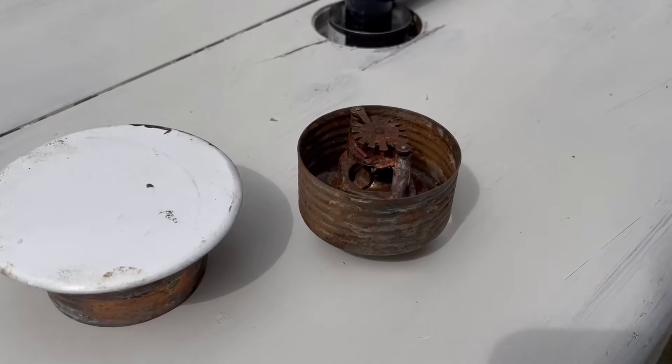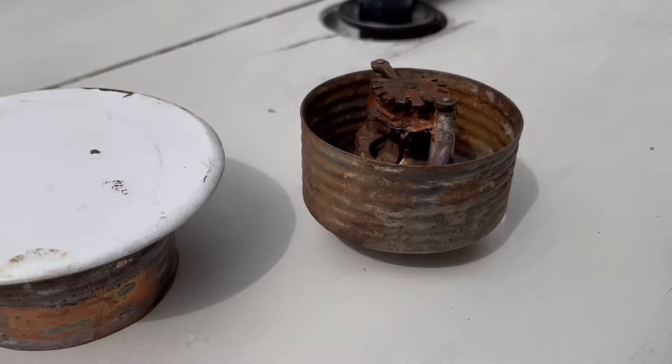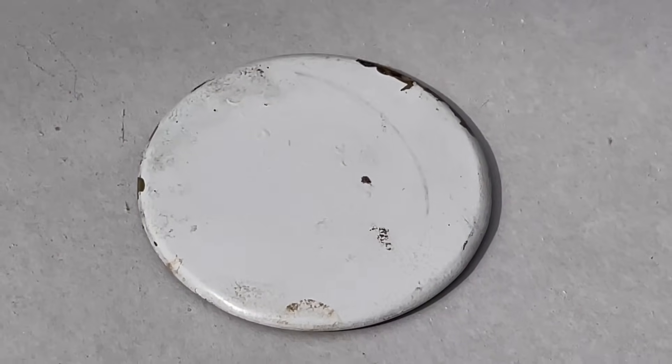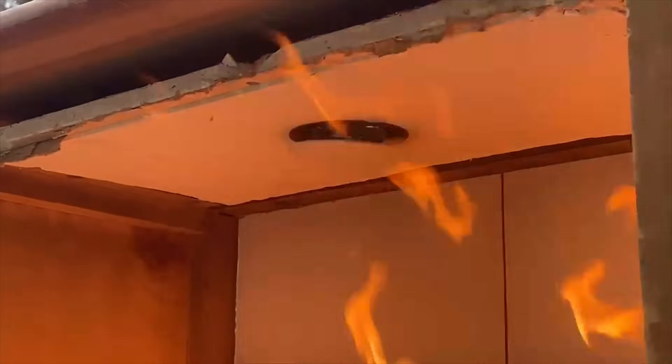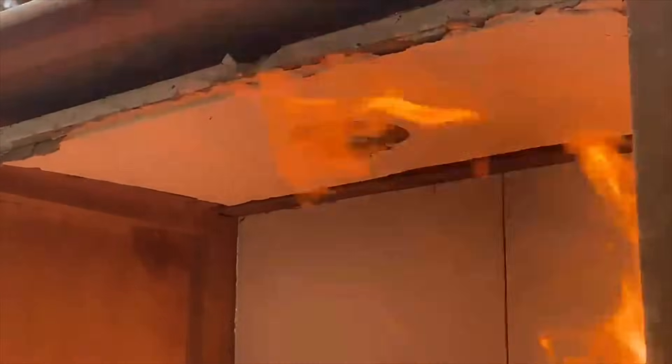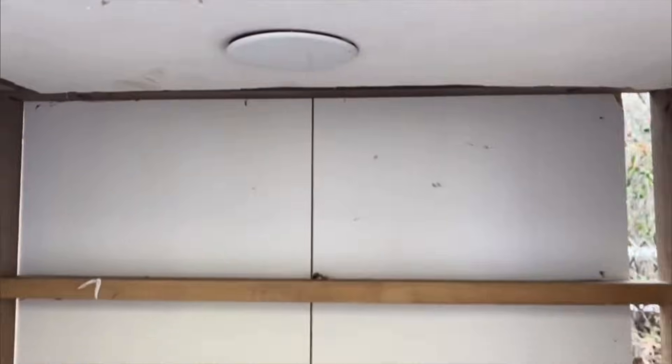This right here is a concealed pendant fire sprinkler head, and unlike the other sprinklers this one is always concealed behind a white — or whatever color you want — cover. This cap will drop off in the event of a fire because it's just soldered on, and once that happens the deflector will drop down and the sprinkler head itself will activate shortly after that. These are pretty aesthetically appealing — they might not even be very noticeable to you, but they do exist and they're pretty cool.